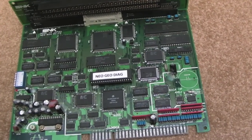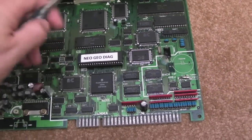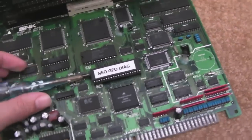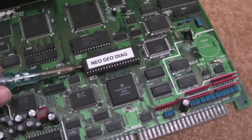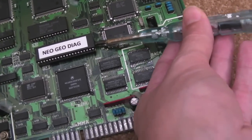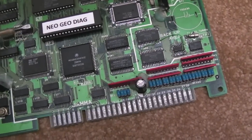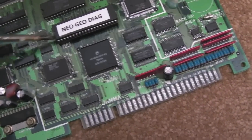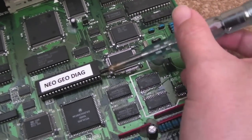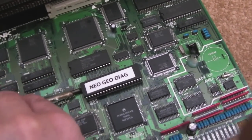I should have done this while I had the ST apart, just to show you. But for these DIP chips where you've got the pins down the side and the socket, it's just a case of getting in between the socket and the chip. Sometimes you might need a finer screwdriver, and just gradually lever it a little bit, then lever it the other side a little bit. And this is the key if you're going to use a screwdriver rather than a proper extraction tool: just do it a little bit at a time - sort of half a millimetre.